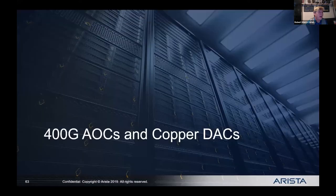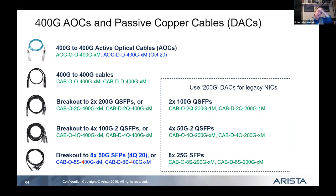One topic that comes up a lot is DAC — Direct Attach Cables. A DAC cable is a copper connection and the least expensive option in terms of transceiver and infrastructure cost. But at higher data rates, even at 100-gig you don't want to go more than three meters — the signal starts to break down. With a transceiver you go electrical-to-optical-to-electrical; with a DAC you go electrical-to-electrical-to-electrical. It's more efficient — lower wattage and heat — but copper signal degrades.